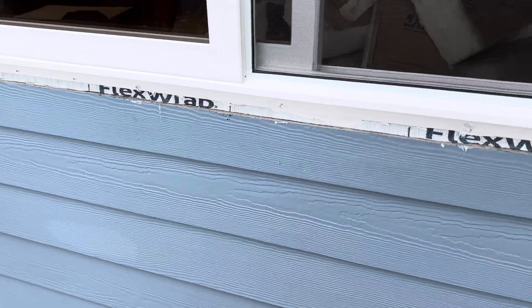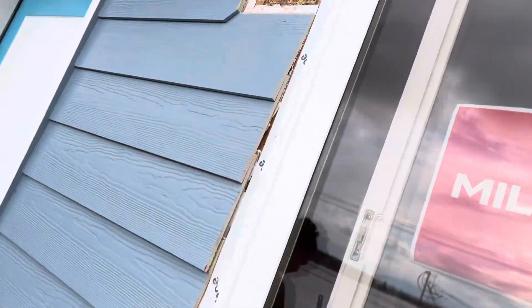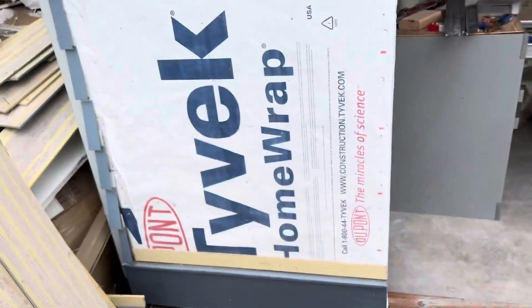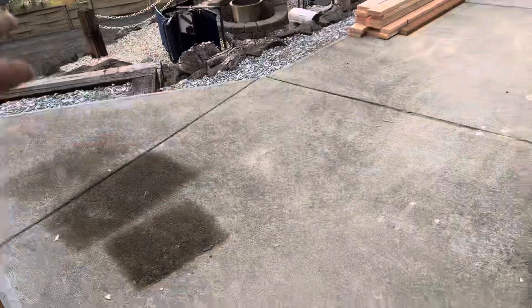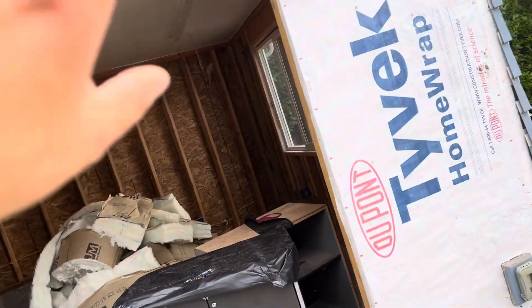That's the best I could do. I taped behind it to try to protect the framing, then I'll tape the sides and then the top. I'll run the paper over that. Over here we're pretty much just replacing this full wall. Obviously board stretchers don't exist, so because this opening is getting smaller we had to replace all these side pieces and the top piece too, because it was easier to get to the nails so we could pull the nails to get this header out. First thing in the morning we'll be able to clip these nails right here, drop the header, and then I can frame this up real quick, sheet the outside, get it papered.